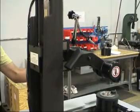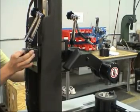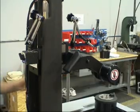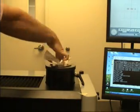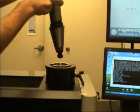Adjusting machine tram. Mount the magnetic indicator base on the tramming block located on the projector arm and a second magnetic base on the counterweight. Wipe out the tool pot and clean the tramming bar with a soft, clean cloth. Place the tramming bar in the spindle, making sure it is properly seated.